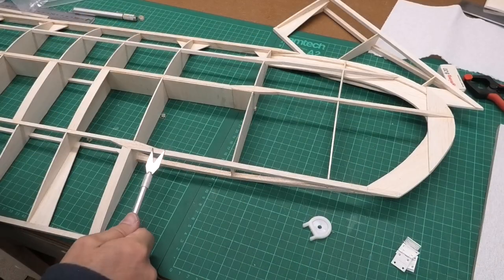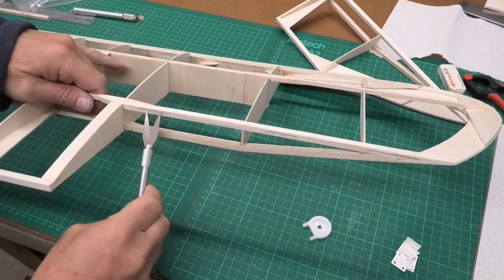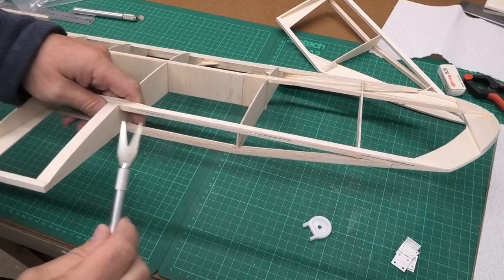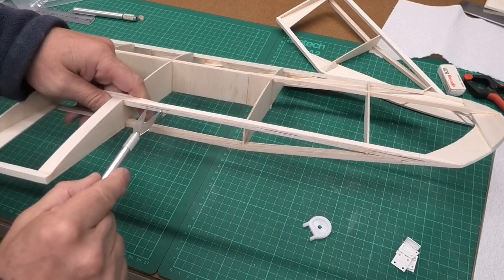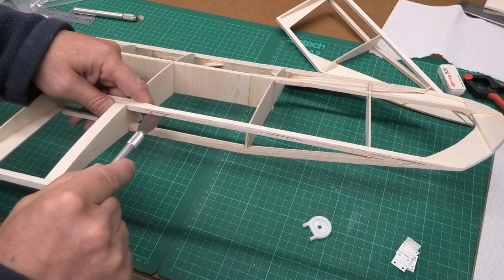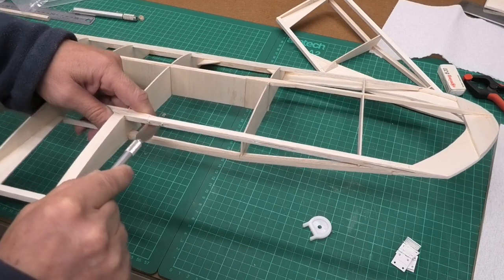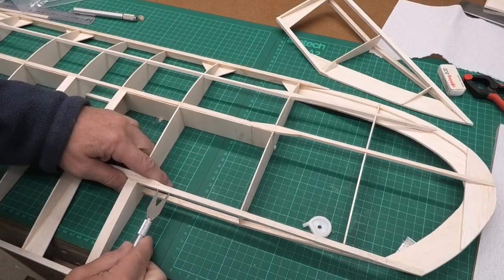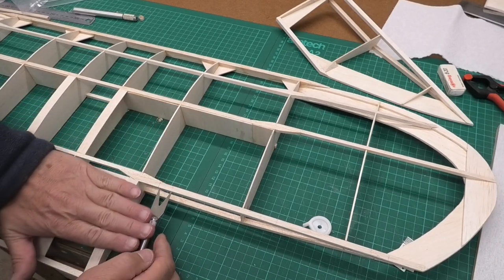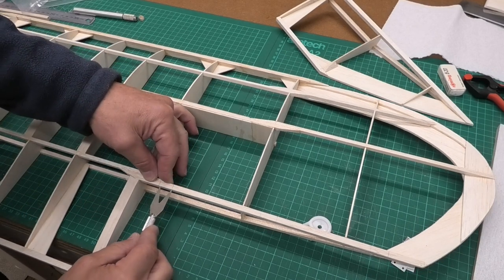Now, I've got the three hinge points marked. I've got the center line for each one, and the important thing to do is when you start the cut with this tool, make sure the spikes are on the line. Just get that started a little bit. I'm going to put that on the bench, and you need to make sure that it goes through square on the timber, and I'm just going to support that at the back